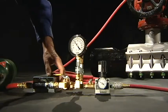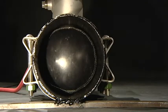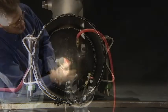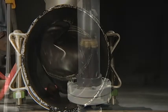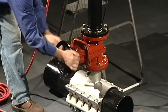Release the inflation pressure and disconnect the inflation hose from the inflation ram, allowing the plug to deflate completely. If there is no pressure on the inflation ram, unlock the chain anchoring the inflation ram and pull out the insertion ram and plug.